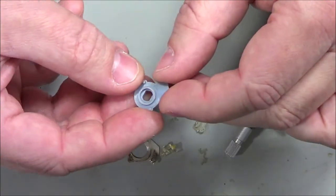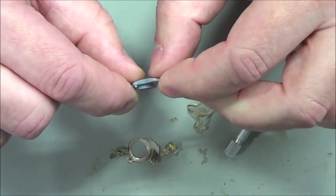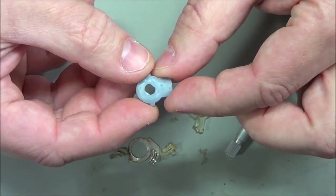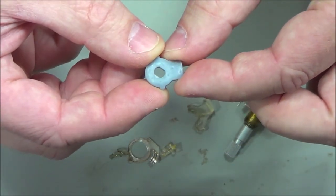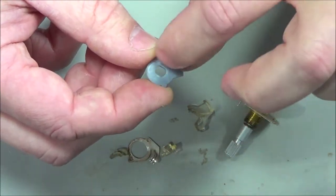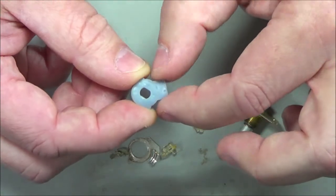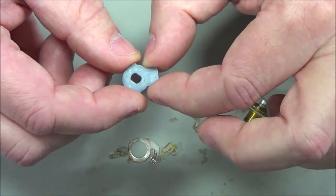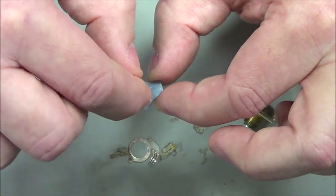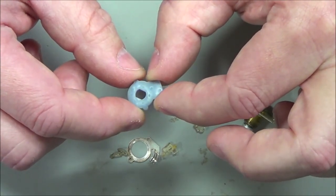The next thing I can check is, and I don't know if it'll work on this ring, because it went at an angle. What happened during the print is this backside is all smooth, and you can see those little dots in there. Those dots are where those supports were. Well, they broke off sometime partway during the print, most likely when this larger surface area started to print, and if the layers weren't adhered very well, those things weren't going to hold on very well. I'm running a better one now, and if that one fails, then I'll have to change the size of the supports, the contact point that goes to the plastic, because normally these supports just get cut off. These just happen to rip off.